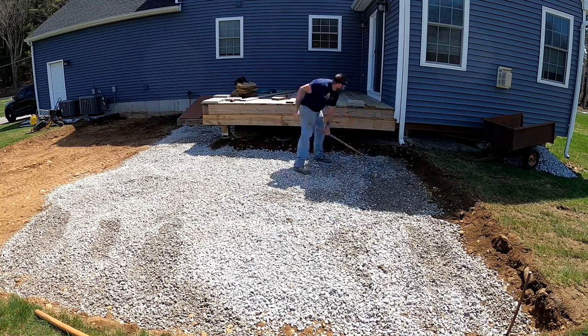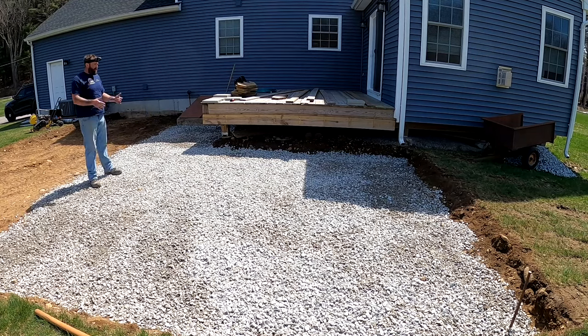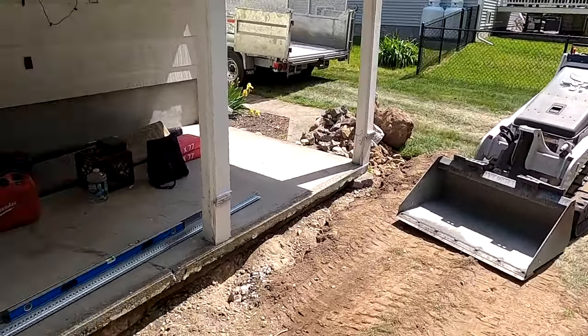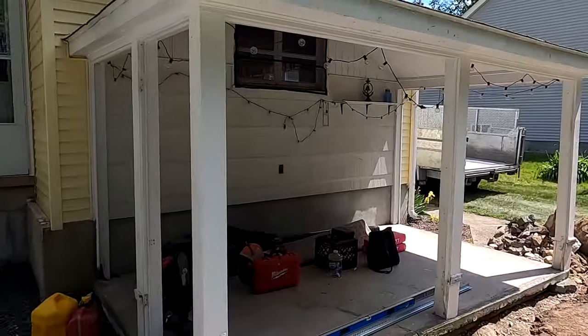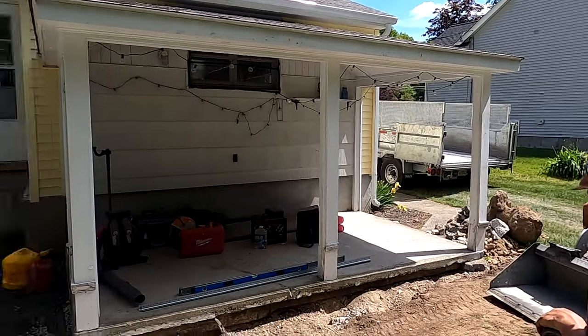I know that's a lot of talking, but I get a lot of common questions on the backfill method that I use and I'm trying to go over it in as much detail as possible. I hope I'm answering the questions — if not, hit me up in the comment section. There are links in the description below on these jobs. We're going to continue digging over here since this area is pretty much all backfilled. We ordered eight yards and brought three this morning — eleven total — and that did this area. We'll probably sprinkle some in here and there to make sure our grade is perfect, but that's pretty close right there.